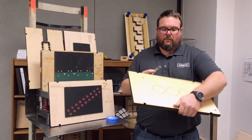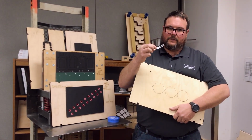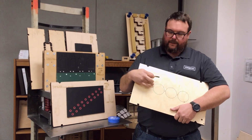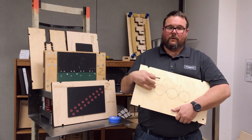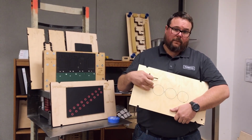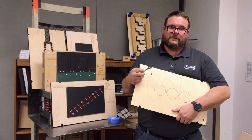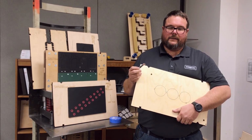However, if you decide you want to add make ready to the back of the die, only use stainless steel shim tape. Never use glassine, and certainly don't use packing tape or scotch tape. The reason is packing tape, scotch tape, even glassine, over time the pressure in the back of the rule will burst and your make ready will end up being non-existent.